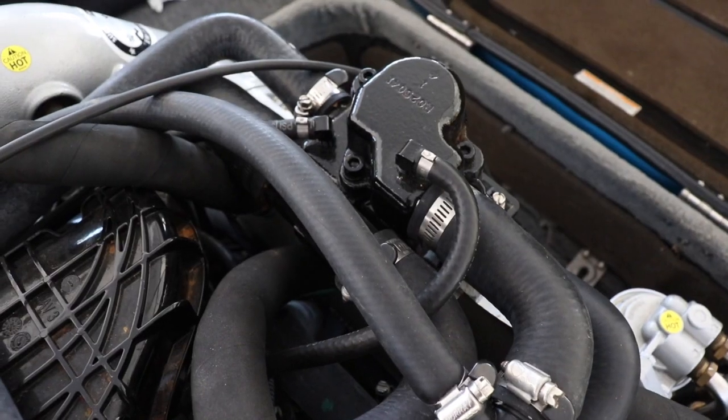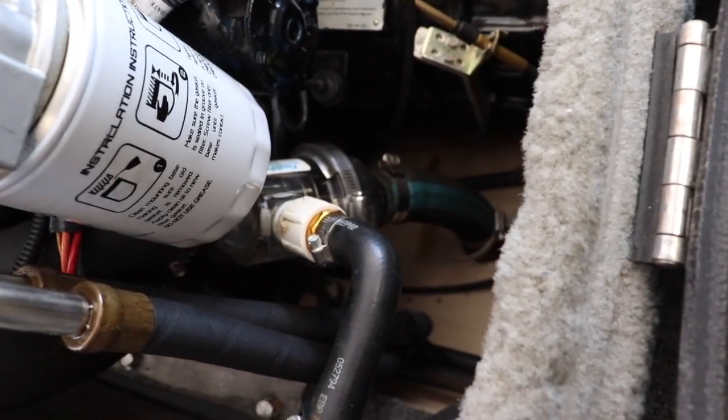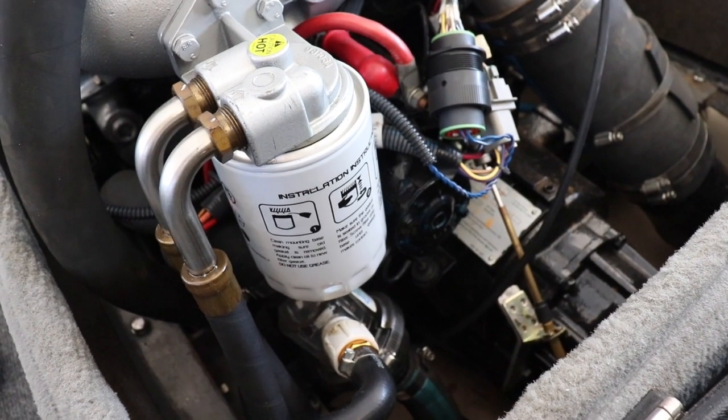When you're doing the fake lake procedure, you just want to make sure that there's water coming out of the exhaust — that's a pretty important thing. If there's no water coming out of the exhaust, you have a blockage somewhere and you want to shut the engine off immediately. Also, make sure all of your drain plugs are in.